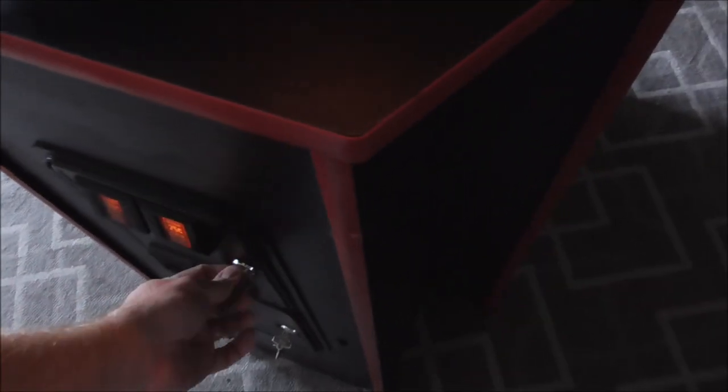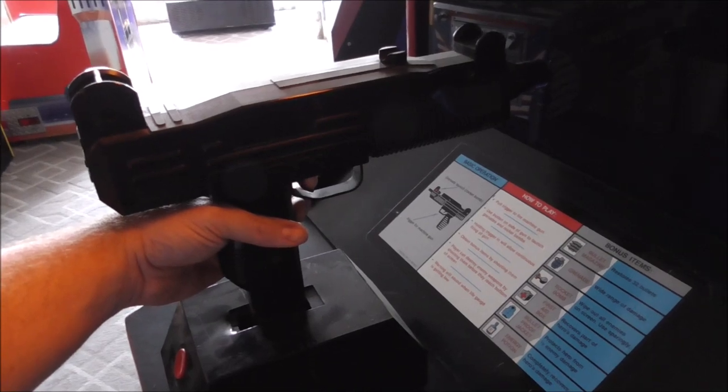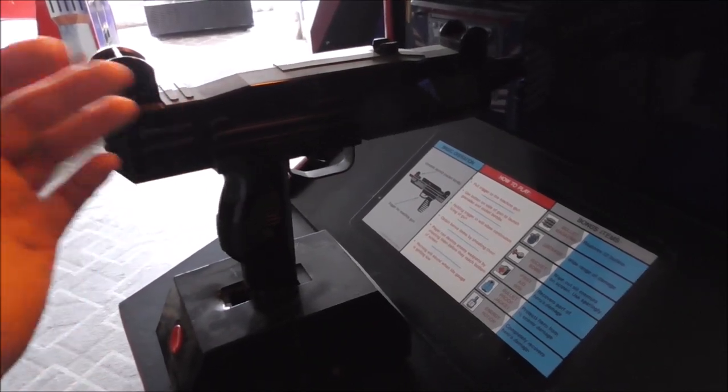Maybe he's crazy. It's working just fine. Yeah, it works for a second, and then stops. So it's kind of weak. So now it's not doing it. But it did do it right when we first started. Weak solenoid. I can feel it moving just a little bit. And when I first started, it did it a couple times.